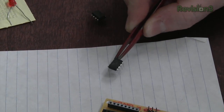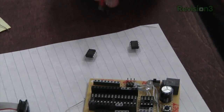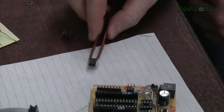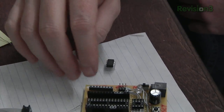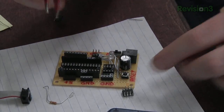It's a microcontroller. Now, the reason I think I might use it is, well, besides laziness, you're talking about like 25 cents for this, you know, just integrated circuit. A microcontroller, you can get these for like 75 cents from Newark Element14. So why not just use a microcontroller? Granted, if you're doing this in large scale, you might want the absolute cheapest solution, but I don't.